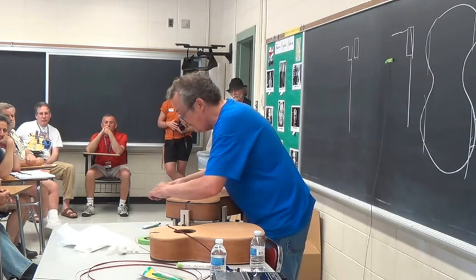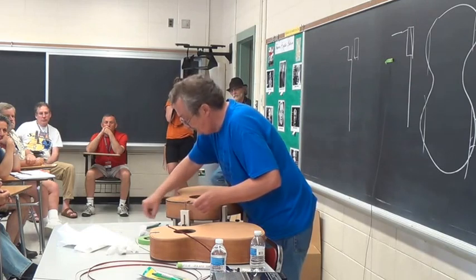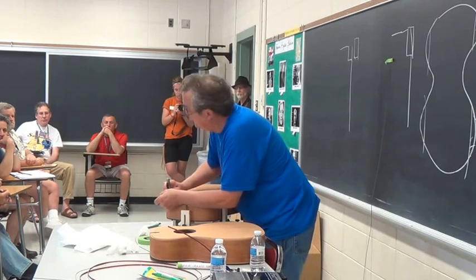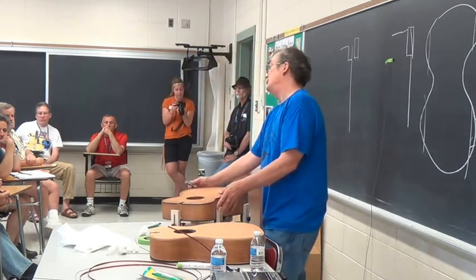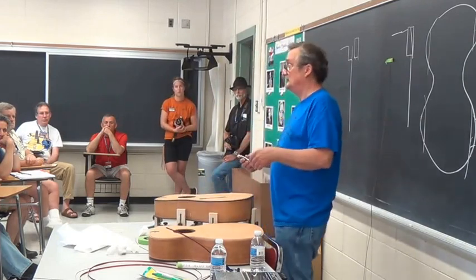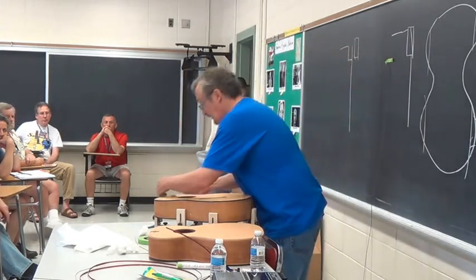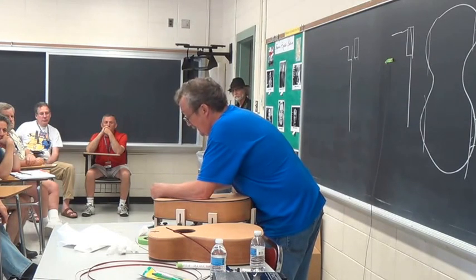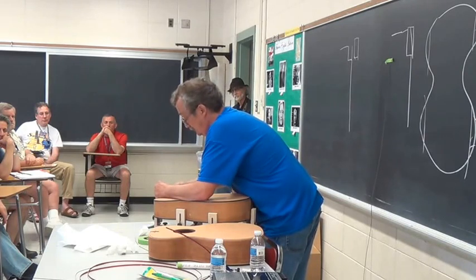If I do have to do gap filling, I don't like glue and dust. Glue and dust can leave a footprint, especially when you get into the finishing area. I think you could agree with that. So my favorite fill is going to take a sealer, whatever my sealer happens to be, vinyl sealer, or even lacquer, if that's what I'm using. And I will sand, let the dust in, and I'll work lacquer in, and then I will make a paste with the lacquer and then work that in on top of that.